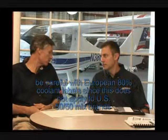I think with DexCool, the maximum would be 66% coolant, and that's if you live in northern Alaska and you want the absolute maximum anti-freeze protection. But for most people, 50-50 is going to work.